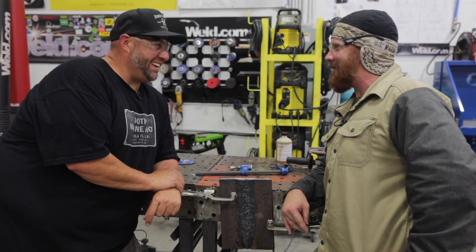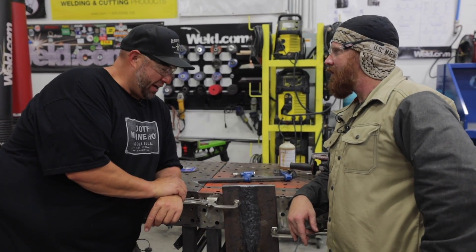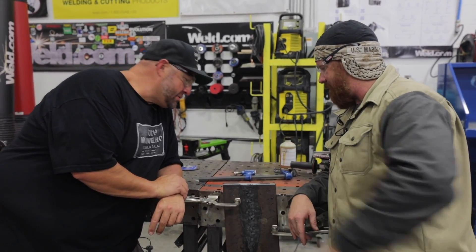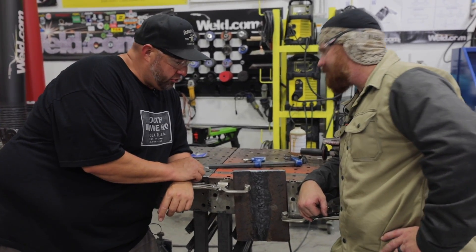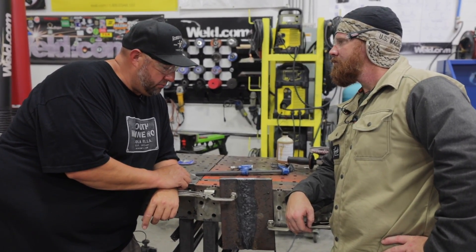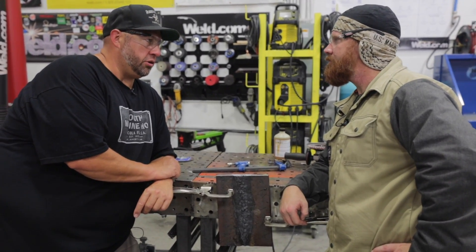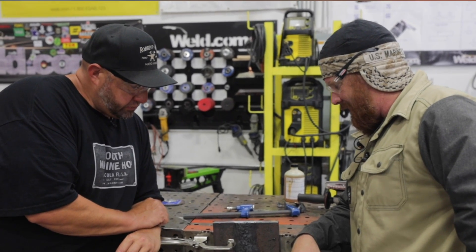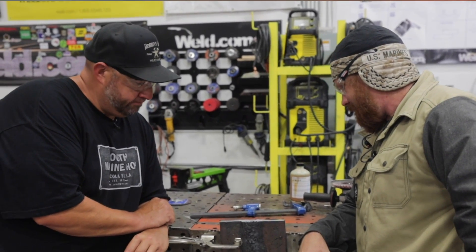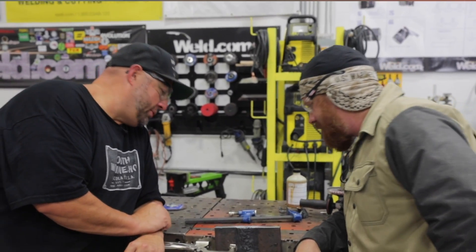This process isn't meant to be run the way we did, but it's cool to mess around with it. How often can you say you ran three-quarter inch welding rod? It's not practical for everyday work - if you've got a small repair in the shop you're not going to bust out the old DC 1000, you'd use a 1/8 7018 or a 5/32 at most. If you wanted to try this again down the road, maybe try a V-joint and see if you can get full penetration on three-quarter plate. The rod is probably inch-and-a-quarter OD with the flux, so you'd need about an inch to inch-and-an-eighth wide opening with a one-inch thick backing bar.